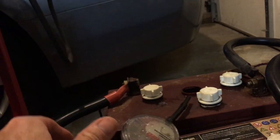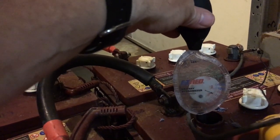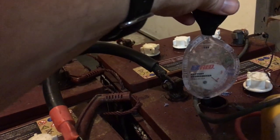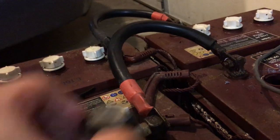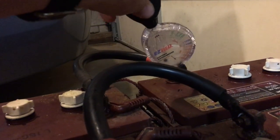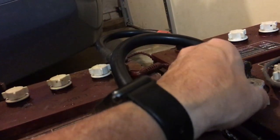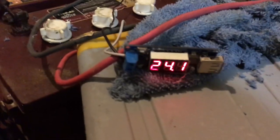And we're probably going to have to equalize the batteries because that was a little bit different from the other one. Let me see if I can go into this one over here. I don't know how much of this you could actually see on the video. Yeah, that one's down pretty good too. 1150. Okay. And again, I'm not 100% sure if the specific gravity would go up if I waited longer or not. Don't remember. Okay, trying to get that one. That one's 12. Okay, so we had some 1150, 1150, 12. Ah, darn it, and I just dropped it. But, this will conclude the test. Thank you for watching.